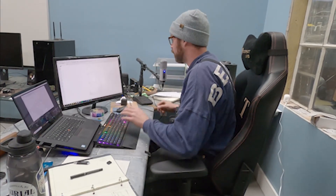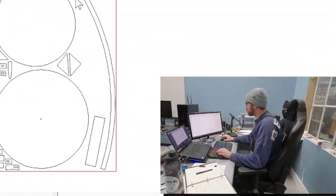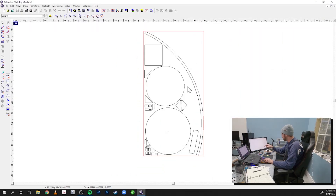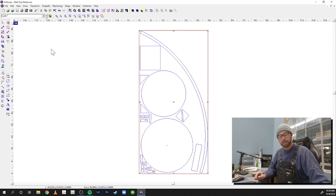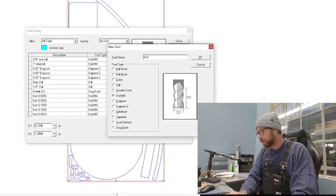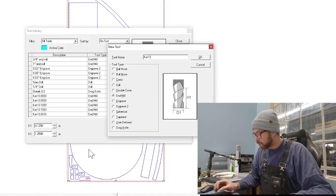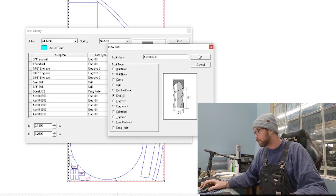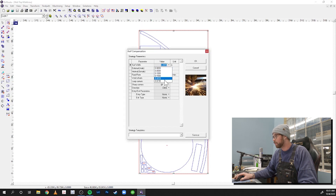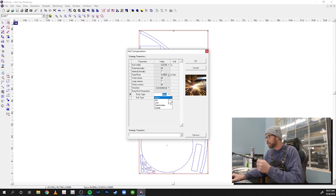We are in inRoute, which is the software that came with the machine. This file started off as a CAD file drawn by our buddy Spike. He drew it on a four by eight sheet and nested all the parts together, so a lot of the work was done for us. Wyatt and I yesterday moved some things around. The kerf width is 0.073, so I go to set up the tool library, make a new tool, kerf space 0.073. Now when we go up to kerf width, we pick our new kerf.